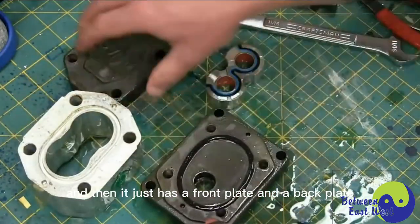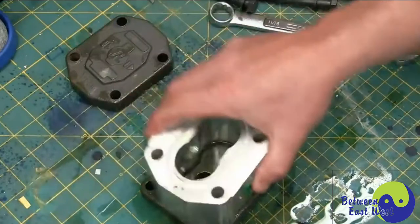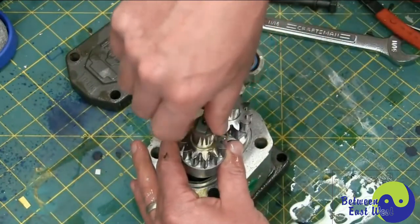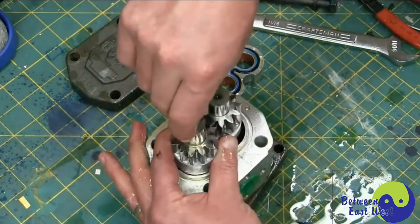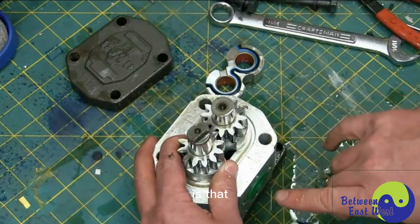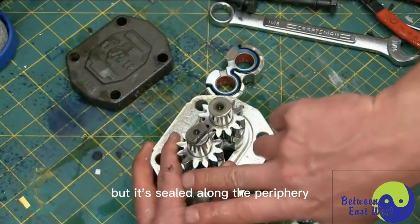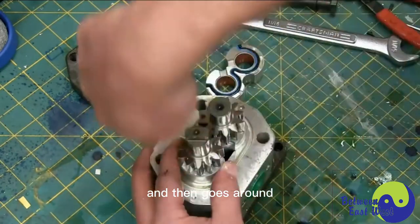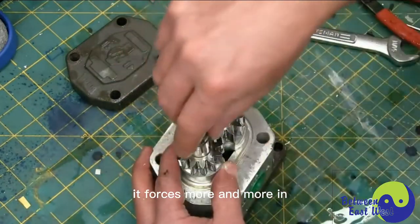It's amazingly simple, actually. It consists of a body that has room for the gears and the bearings, and then it just has a front plate and a back plate. We drive this shaft and it turns the gears. When this gear is getting turned from the inlet — the big one — to the outlet, and we're turning it this way, what's happening is that oil goes in this side, so this is flooded from the tank. There's oil in here, but it's sealed along the periphery. Oil gets in between the gear and goes around the periphery, and for every rotation it forces more and more in.